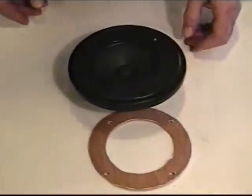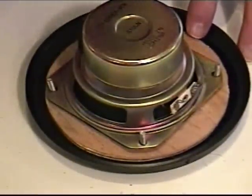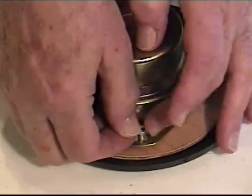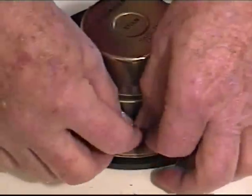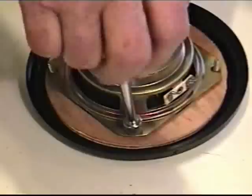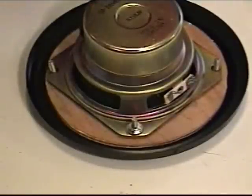We'll come back later on and show you how it looks once it's bolted in, and we're going to solder some wire to it and mount it in our coffee can. Okay, we've got our speaker now mounted to our baffle board made into the lid of the can. We're going to take some washers and some 6-32 nuts — I'm using half-inch screws in this case — to bolt it in. You want to tighten it down pretty snug because you're dealing with audio and you want a solid connection.